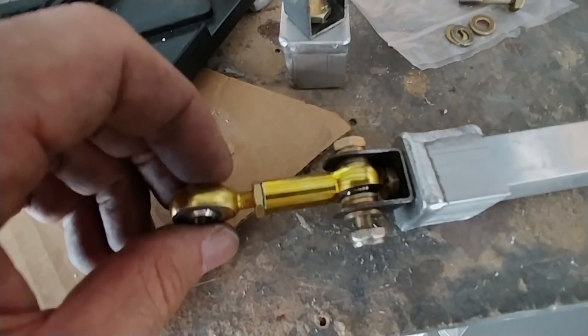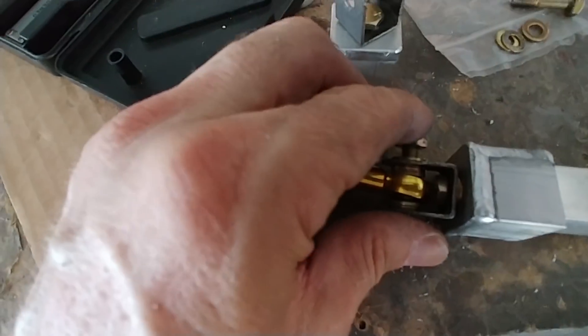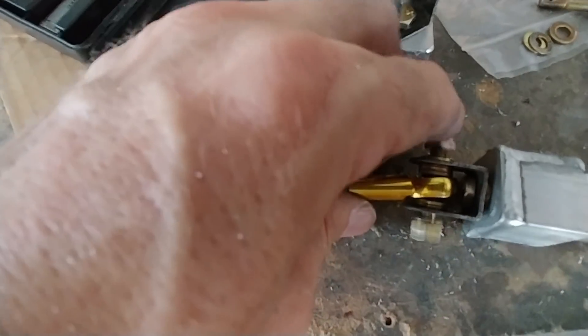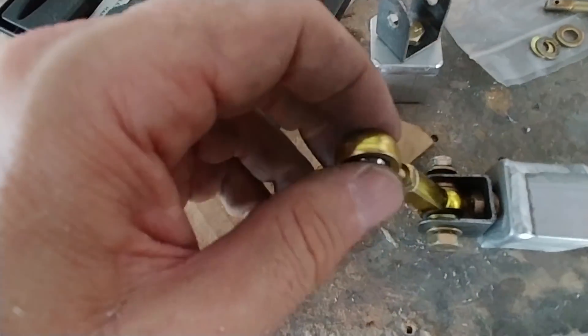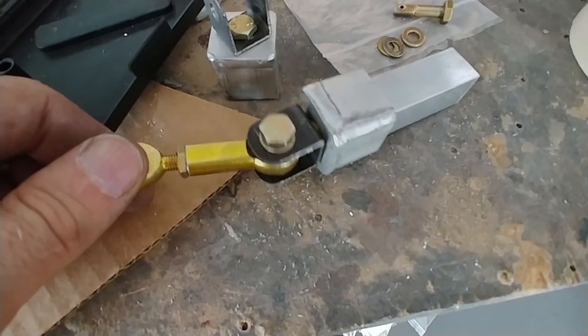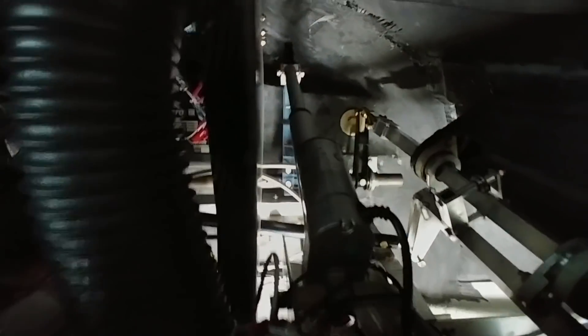This is what it looks like now, just mocked up with the rod linkage. I've got some spacers in there and that bolt will be done up tightly when it's all done, so there's no sideways movement but everything moves smoothly. This is what it's going to look like when it's all put together. That square tube will be match drilled through the 7075 square tube when I get it, and that completes that linkage.